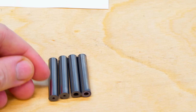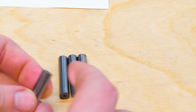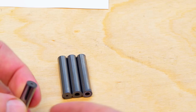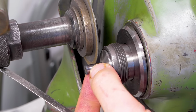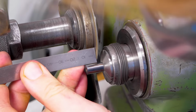Next, we cut it into 10mm long segments because that's the final length. Well, cut it slightly oversize, and then surface grind them to final length. Cutting off the blanks in the tool and cutter grinder. Getting a rough length using a scale. Final length will be surface ground anyways. They just need to be a little bit longer.